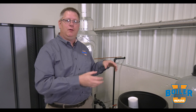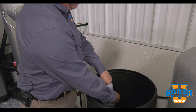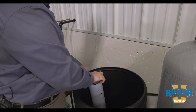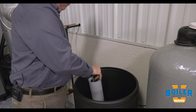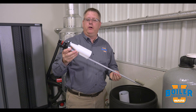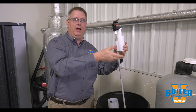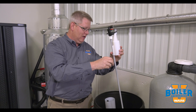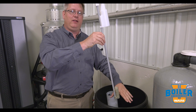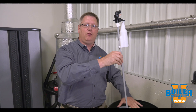The second part of maintaining this is pulling and inspecting the foot valve. The foot valve plays an important role. First, it keeps the tank from overfilling when the brine tank is refilled by the softener automatically. But the second thing it does is it actually prevents the softener from sucking air by completely draining the brine tank during regeneration. So it's got a minimum level and a maximum level.